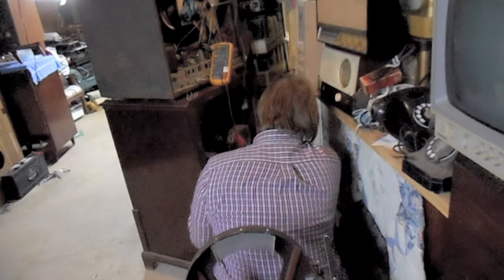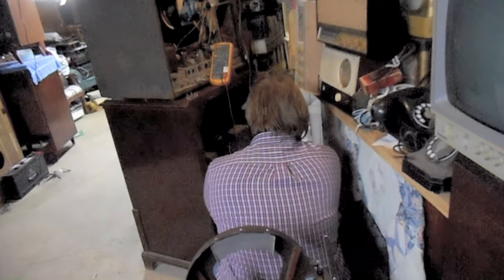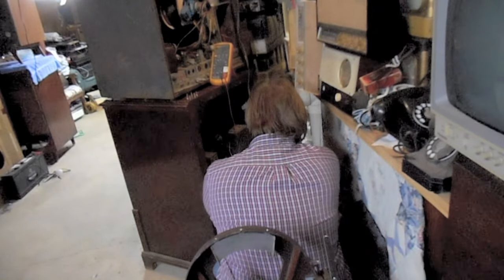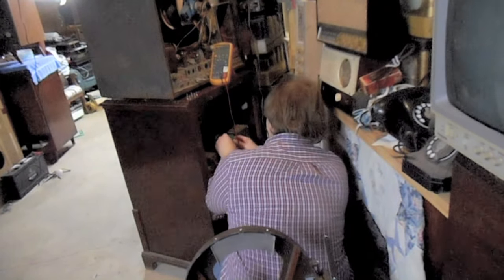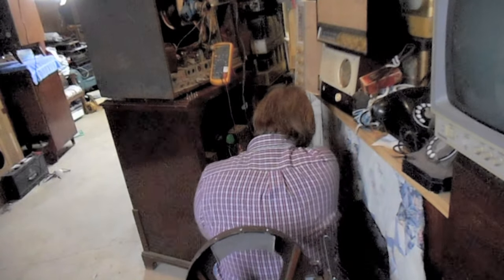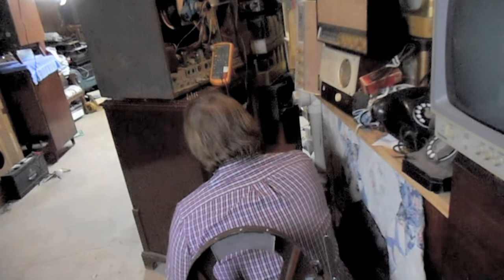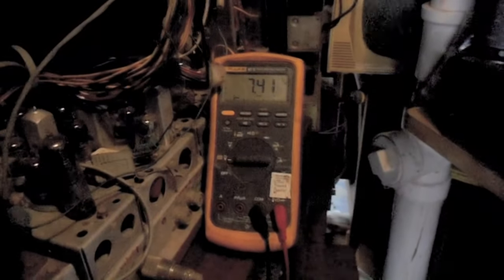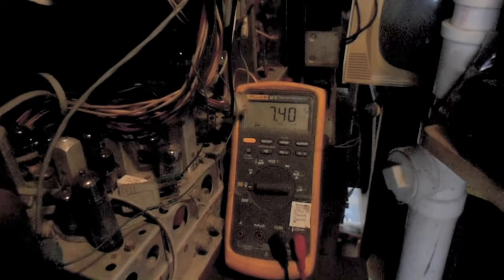So, here goes brightener number two. Ow, I'm gonna unplug this just because I'm concerned about potential high voltage coming off the base pins. I don't think that normally happens on good picture tubes, but I've seen that on gassy picture tubes. And it has me gun shy. So there's two brighteners in series. I am not seeing a significant increase, at least, in the heater voltage over before.